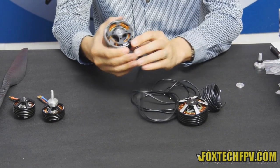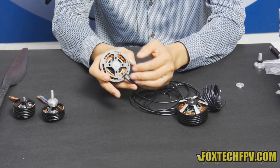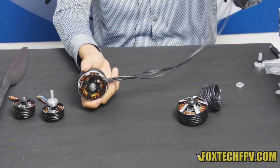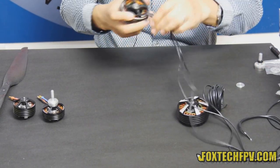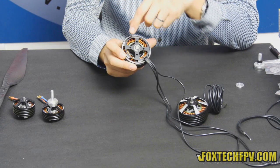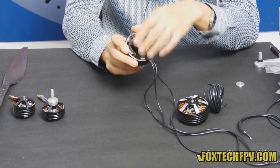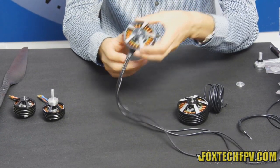Looking at the tail, you can see a very nice black and silver color finish. There is also a 15 centimeter long silicone wire right off the front of the motor, which is a very nice feature for direct use on a hexacopter or quadcopter arm. The mounting hole spacing is a little different — on the 50 series it's 20–25 millimeters, but on this one it's 30 millimeters. Be careful when choosing this motor for your frame, because it is really huge.